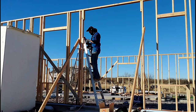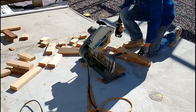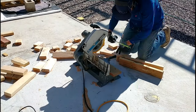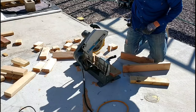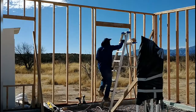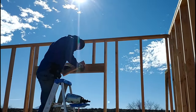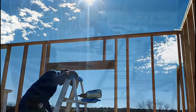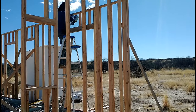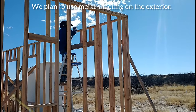To explain the construction sequence: the next layer will be 7/16 OSB sheeting along the outside, covering the door and window openings. I'll come back with a router and cut those holes out. On top of that sheeting goes one-and-a-half-inch foam board, and the 2x6 extensions will come out far enough to be flush with the edge of the foam board. After the foam board goes on, we'll put on house wrap that'll come into the windows and seal everything up, and on top of that will be furring strips — like purlins — that will attach the exterior sheeting, which will probably be metal.